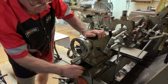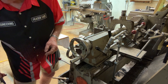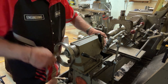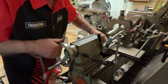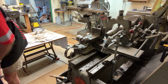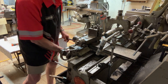The first thing I need to do is remove this stop screw — it basically just stops the tailstock from sliding right off the end when you pull it back. The tailstock can now be pulled straight back. It's quite a heavy piece of kit so bear with me — I might be doing a bit of grunting and groaning while I lift this off. Fair old weight in that. I'll put it down securely out of the way, and there we have a nice clean run at the back end of the shaft.